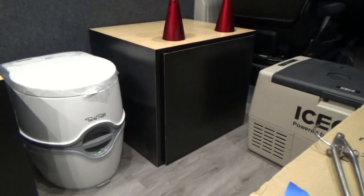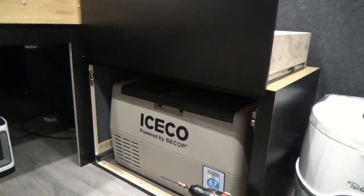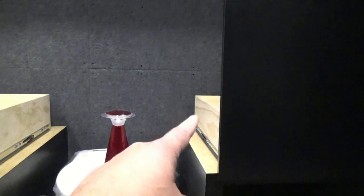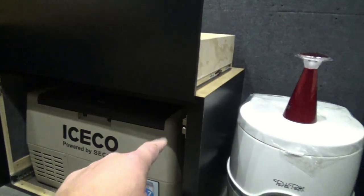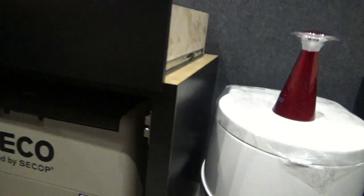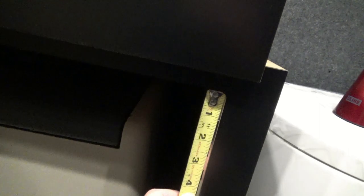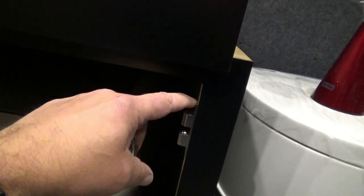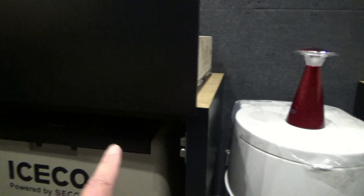Well, it's not going to get done if I'm just sitting here, so I got to move it. Okay, here's where we're at. The drawers are complete, except for finish on the insides. We'll do that later. Now I'm getting ready to install the catches. I still have this one to do. We're just kind of eyeballing things, measuring down about an inch from the top for the top edge. Then we'll get those installed on this side, and then we'll put the drawers in, and hopefully we can line everything up.